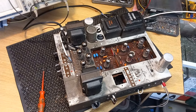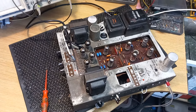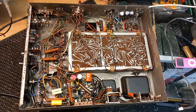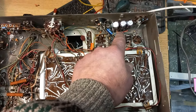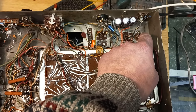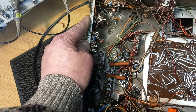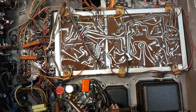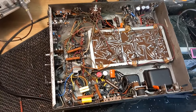Thanks for watching — you get these ones now and again where whatever you do you just can't get them 100% perfect. This one I'd say is 90%. Here we are on the underside of the amplifier. It's been partially recapped by someone else previously, but I've done the electrolytics, the voltage doubler capacitors, and the smoothing caps in place of the can on top — which is now just there for show — along with two more on the other side of the chassis. I've also altered some component values around the volume control to give it a better bass response. I've gone all through the PCB, checked everything — no dry joints anywhere, all grounding checks out. But I just cannot get rid of this buzz.